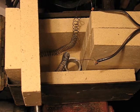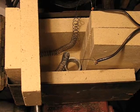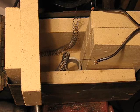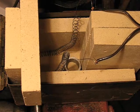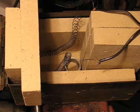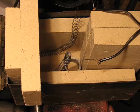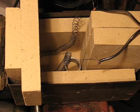For right now, let's test it and see what it does. By the way, this is not the first time I've powered this wire up. Like I said, I cut about 10 feet of it to give me around 1500 watts on a standard 115 to 120 volt circuit. I wound it around approximately a half-inch form and stretched it out a little bit so none of the coils touch.